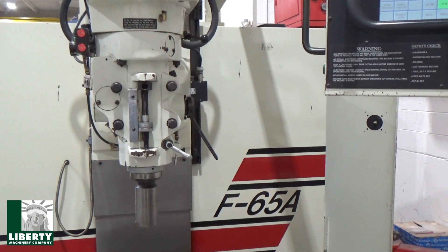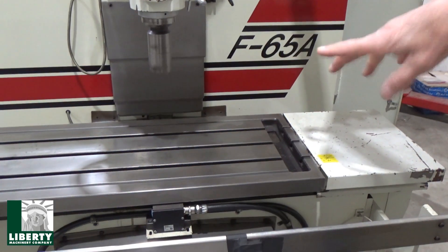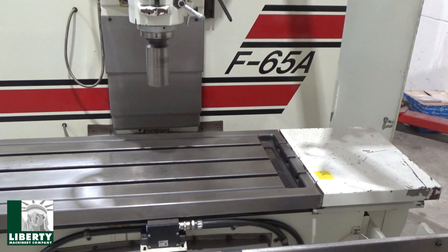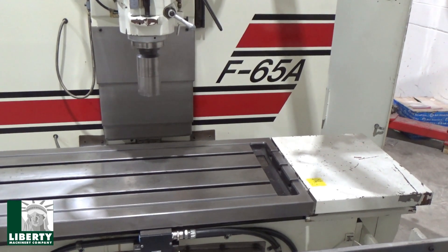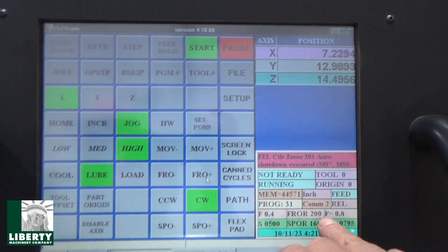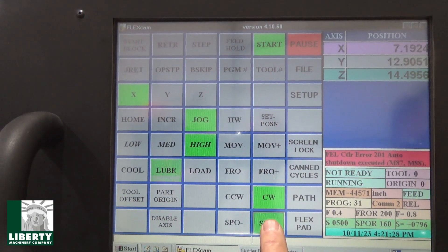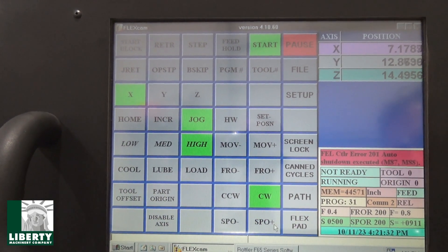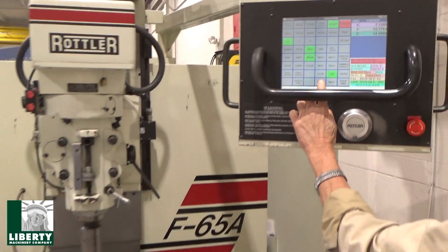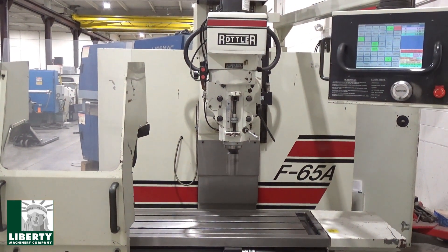So while it's running I can override it and jack it up a little bit — 600, it's all moving. I can do the same thing with the feed rate. I'm bringing the clockwise spindle up: there's 700, 800 — still moving. Let me bring up the feed faster. Speed it up to maybe 200%. Even though we're calling for 500, I'm at 800 on the spindle. It's going to jump another 100 — 900. Sounds good, looks good. We're still moving on the program; it's going to back out here in a second. Back down to 800, 600 — coming out.